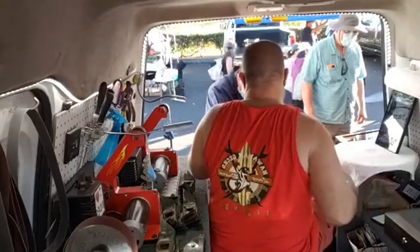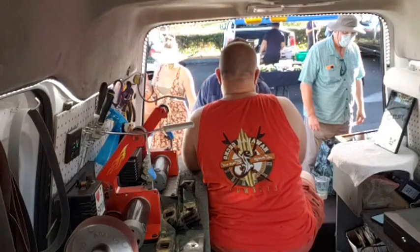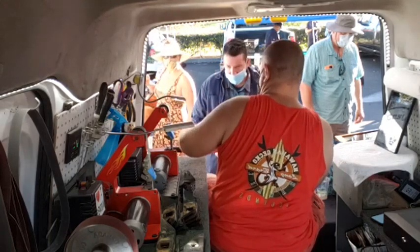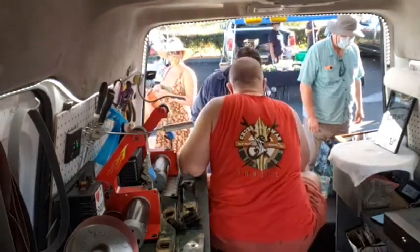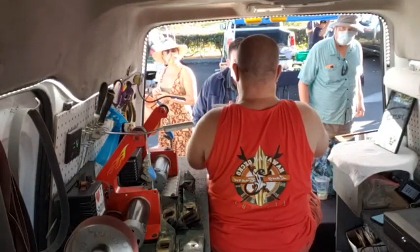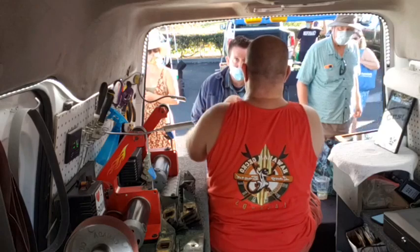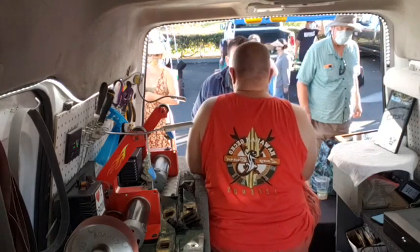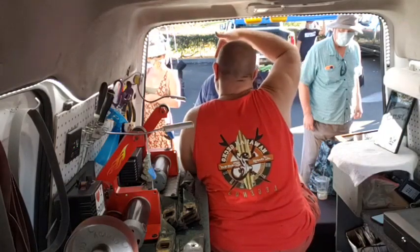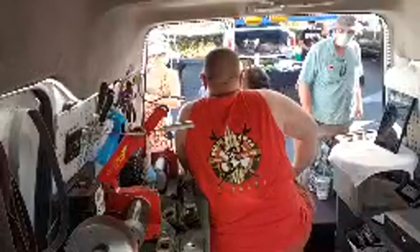Absolutely. First time through, they're still a little rough on them, but I removed the damage and the tips are super pokey. And I dropped the bolster down so it'll actually hit on the cutting board properly when you're doing things. This is called the bolster. On these types of knives, you can't actually whetstone sharpen. You have to remove some of the bolster so that the knife will hit the cutting board and chop through properly. So I always do it, it's called bolster reduction. As the blade goes down, the bolster comes out, and it looks like a high heel on a shoe. I got it. Anyways, you're all set. Thank you.